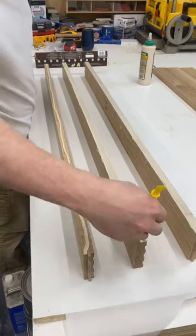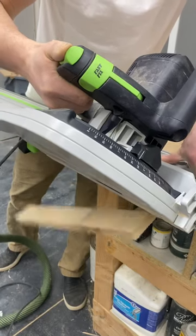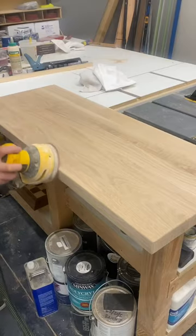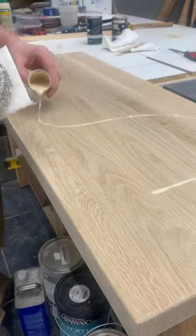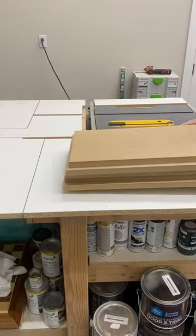I'm going to be building a second bench and storage area just across the mudroom. I always use Titebond III for all my projects. After the glue cures, I sand it smooth with 80-grit sandpaper and work my way up to 120. I use a cordless sander attached with a non-abrasive buffing pad to evenly and quickly apply the oil stain.